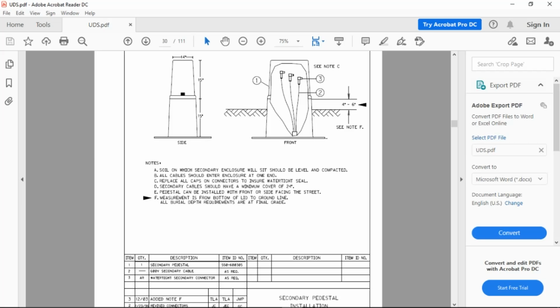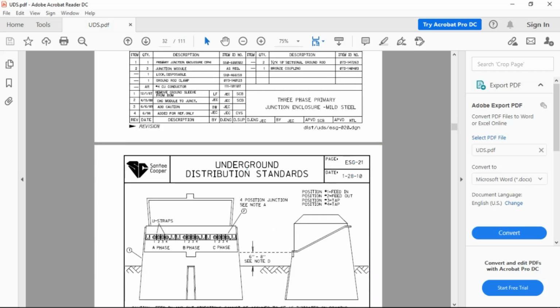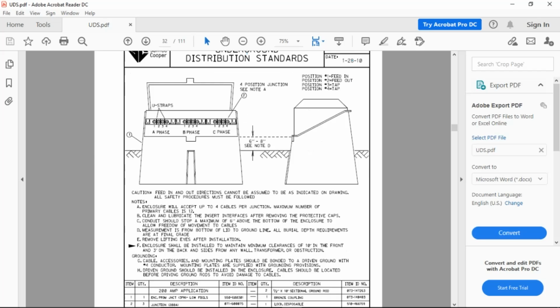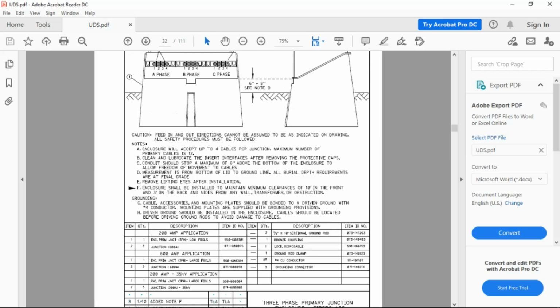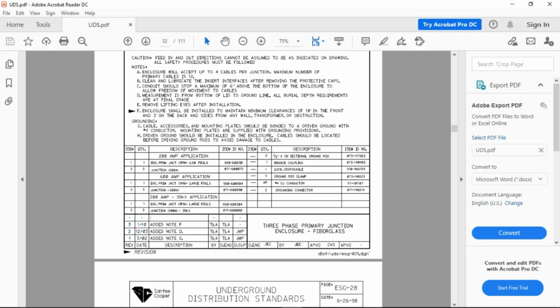You will also need to know the amounts. How many do I have in here? Three watertight connectors. So secondary enclosure is an ESG-4. Primary, three-phase primary enclosure is an ESG-21, Echo Sierra Golf -21. What parts do I need inside of it? Of course, I need the enclosure itself. That's number one. What's number two? It's in the description. Junction, 200 amp. Don't need to worry about the 600 amp. They've got junction 200 amp.